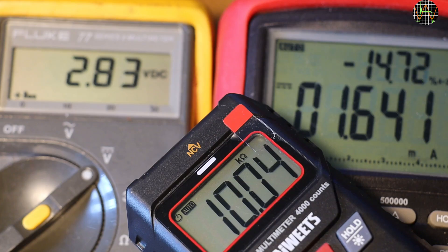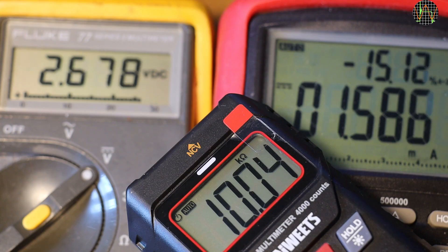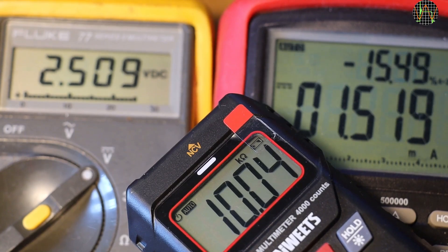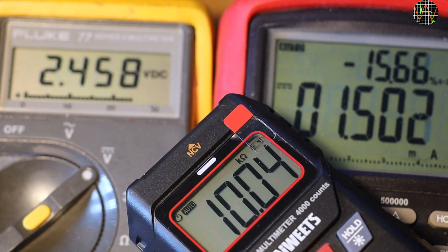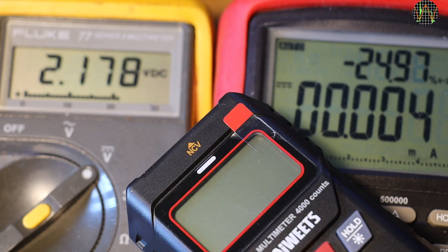Can you use rechargeable batteries instead, which seem to be more resistant to leakage? Instead of 1.5V, rechargeable batteries have a nominal cell voltage of 1.2V. To fully utilize them, the meter should ideally show a low BAT symbol at 2.4V or less. Sadly it shows it at just a tad under 2.6V, at which point your rechargeable batteries will still have most of their charge left. The meter still works correctly down to about 2.15V and simply turns off at 2.12V. This means you can ignore the low battery indicator and drain your rechargeable batteries, but the only issue is that the meter will finally shut down without any warning.